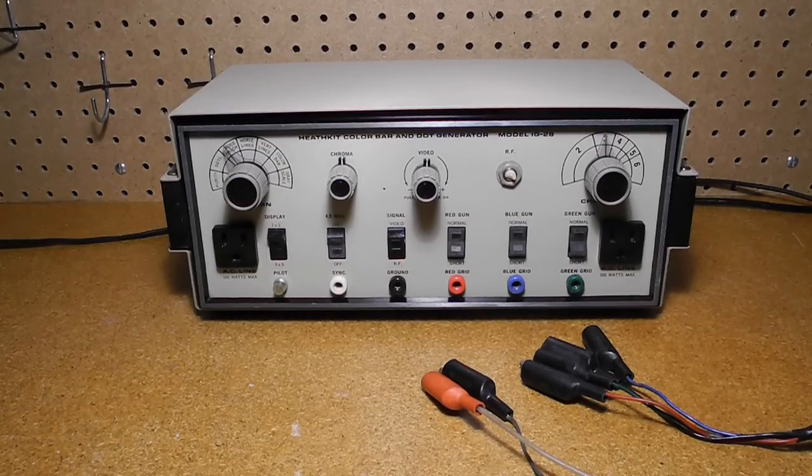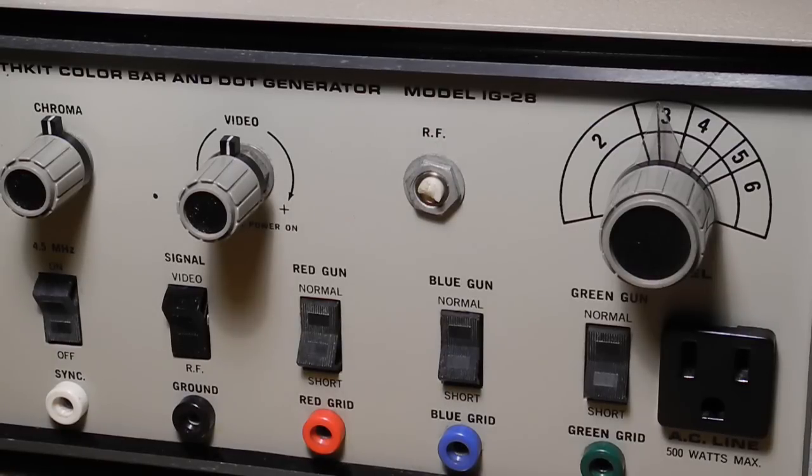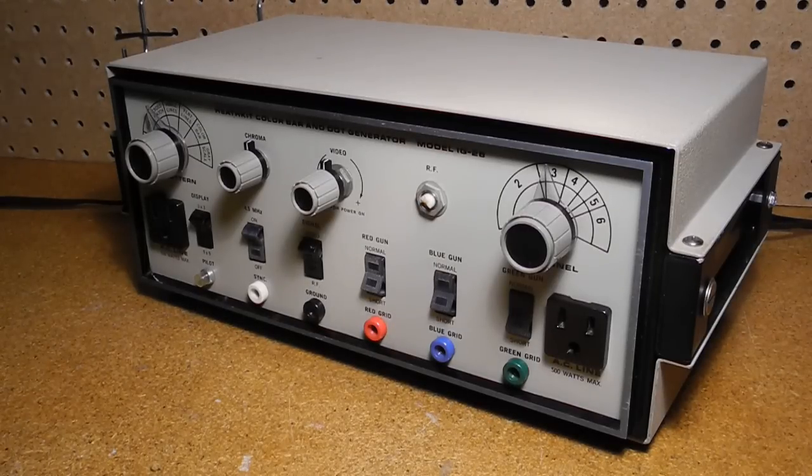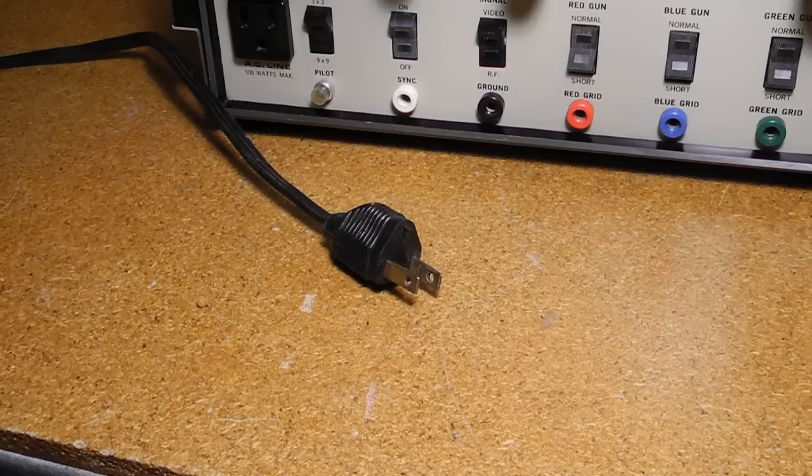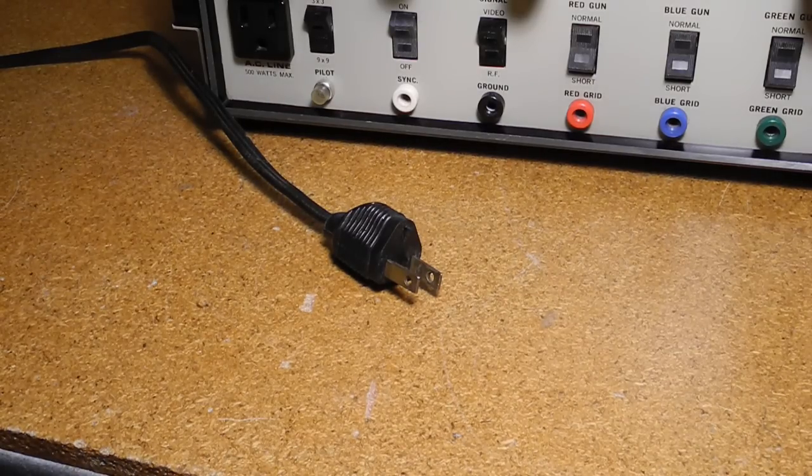I bought this unit in December of 2015 from a buyer in Quebec, Canada. It was sold as-is and the seller didn't know if it was working, but it appeared to be in reasonably good condition. It arrived well packed and had the original cable still attached. On the outside it was quite dirty, almost muddy. One knob was missing and the plastic shaft for the RF control was broken off. There was a little rust on the case, but it was pretty clean inside. I cleaned the case and knobs. One of the case screws was not original and a standoff was missing — I replaced both. The Heathkit stick-on feet had slipped, so I removed them and re-glued them with contact cement. The plug's ground lug had been cut off — this was not good practice, but it was often done so the unit could be floating from ground and used on televisions with hot chassis.